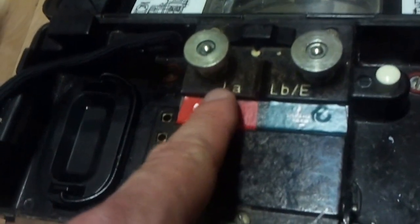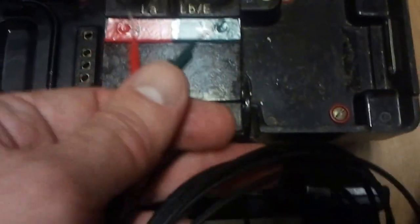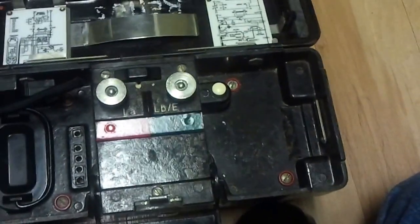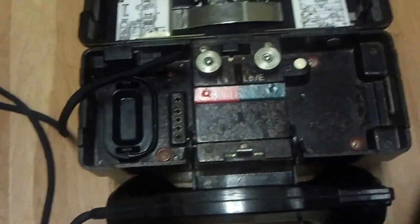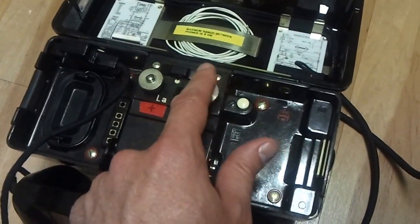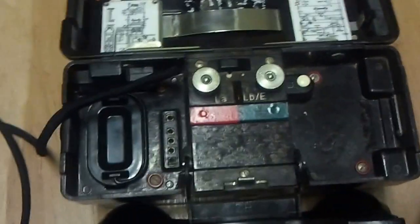The terminals have a hole through them — you put your wire through, positive and negative. One other technique: if you don't have enough two-strand wire and need to set up two field phones in emergency communication, you can split your wires, connect them end to end to make one long wire, connect positive to positive, and instead of connecting to the ground wire, run a short wire to a ground rod in damp soil on both ends. This is called single wire grounded communication.